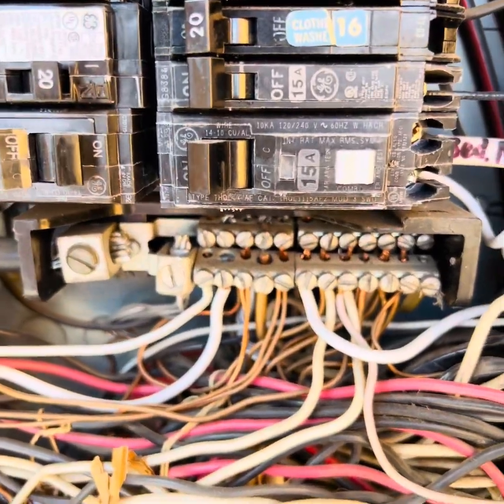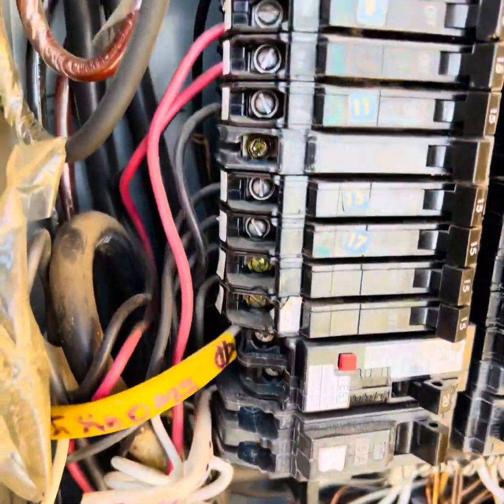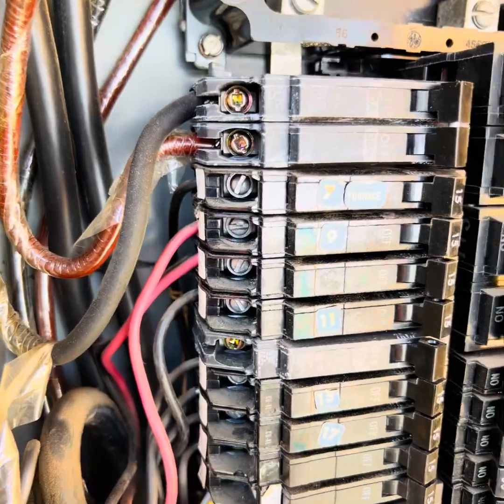Also, it causes oxidation. All of your wiring actually vibrates just a little bit as electricity moves through with that current. Aluminum wiring is going to vibrate more, especially if it's expanding and contracting more than copper wiring. You also don't want it to be vibrating at the same time, and this happens to expand and contract more, and vibrating is not going to be a good combination on your breakers. So we just don't want that wiring to work its way loose, causing a potential panel fire or a house fire.